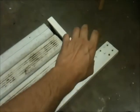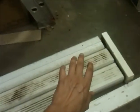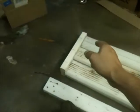The whole idea is you build this box and you have holes on the bottom — cold air enters, heats up, and of course hot air rises, so it goes up the box. The top is going to be up against a window or a solar dehydrator box as an exit. To be really efficient, you might want one inlet traveling up, then a transition going down, and you might need a little fan to move air that way, which heats it up even more.